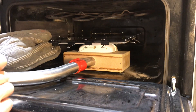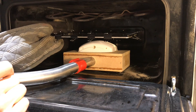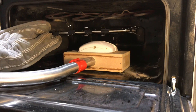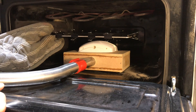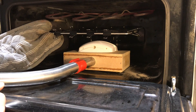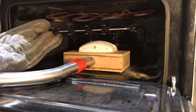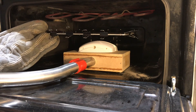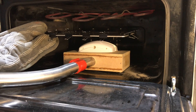This is testing the homemade vacuum forming machine in a slightly — or very — homemade fashion, using the grill in my oven. Waiting for the plastic to heat up and get to temperature. Once it gets to the right temperature I'll know because it will sag just below the aluminium frame. It will sag, but hopefully not too much, and that will give me an idea of when it's ready.